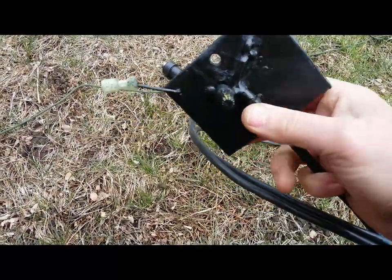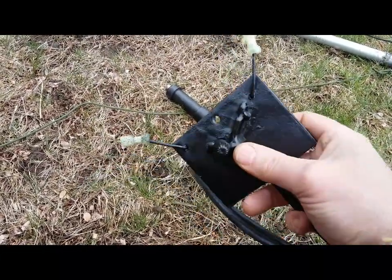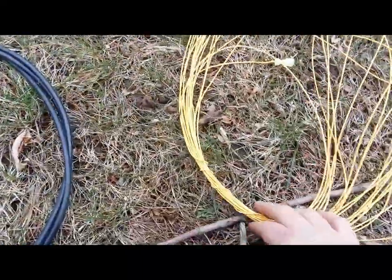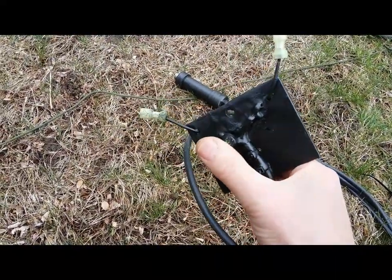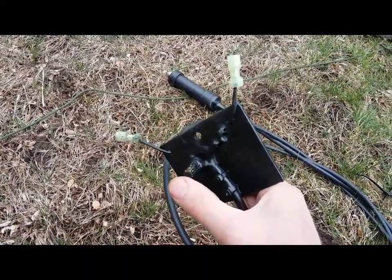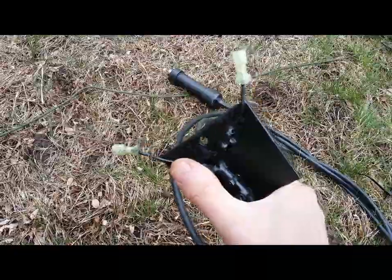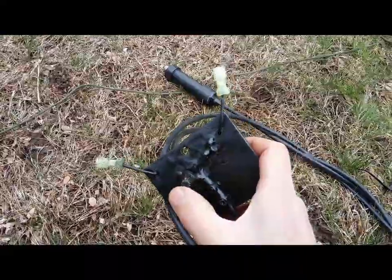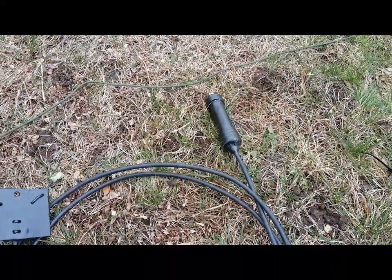Create a feed point — this is an old plastic cutting board. The thing with 75 ohm coax is you cannot solder to the shield. What you can do is bring a set of pigtails out with quick disconnects where your element will connect. On the shield side, I use a wire nut — you could use a crimp. Fill it with some dielectric grease, take the shield, wind it up, stick it into the crimp. Take a length of wire for your pigtail connector and put that into the crimp, smash it down, and that'll give you a connection for the shield.